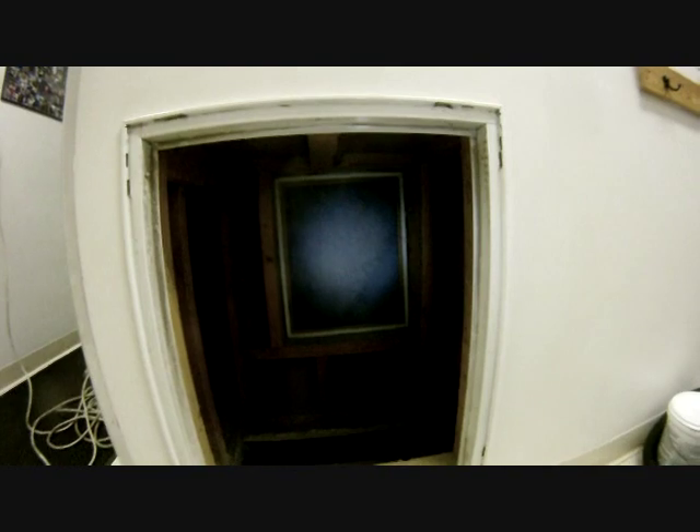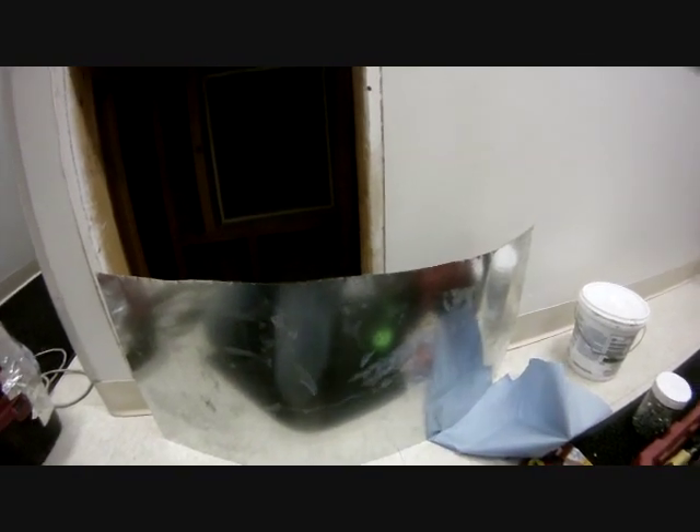I'm going to go back upstairs and start building the plenum out of metal. This is our return drop. There's a return on the far side and a return on the near side — I've taken the door off. You can see the dirt buildup inside. The new stuff is down there looking very nice. I'm going to vacuum out the rest of this and seal it up just like a metal plenum. I measured my first side: 15 and a quarter across by 32 and three quarters. Going to put that piece of metal in there.